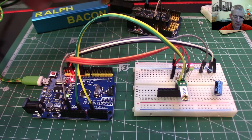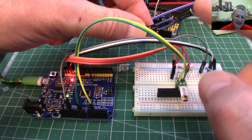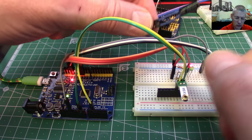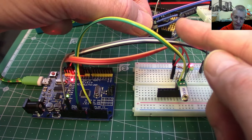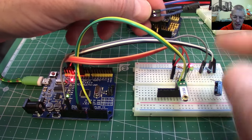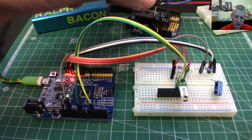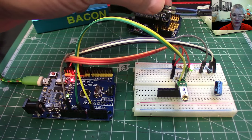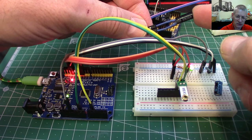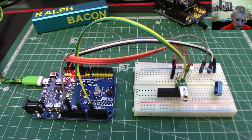Thinking about it — with the vibration detector we've got an analog version of the tilt switch, going from nothing all the way up to 1023 steps. By specifying an AREF voltage you can make it as sensitive as you want. When we were talking about the tilt switch earlier, tapping it would act a bit like a vibration switch by design. The ball inside is light so it bounces and creates that tilt mechanism, but it is only on/off — you can't measure intensity. The mercury ball is definitely either on or off.